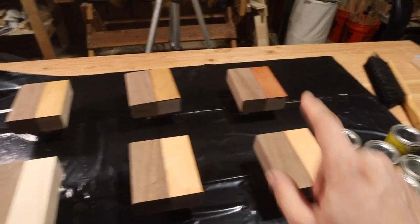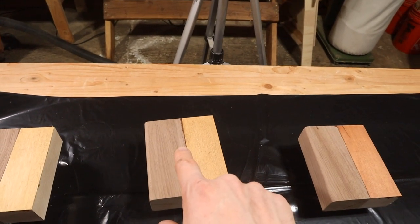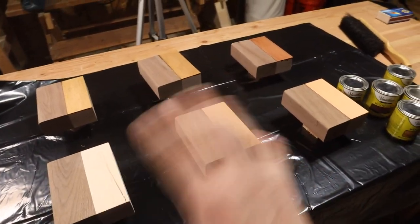Okay, so I reapplied the stain, and as I was concerned about with the blue tape, there was a little bit of bleed under all the way around. I know that they have the frog tape, the green tape, which is supposed to be better, but I don't even want to mess with trying to keep the stain off of the walnut in the final table.